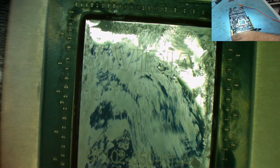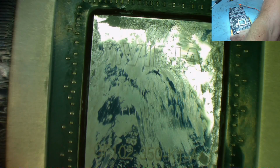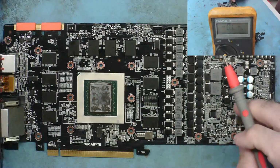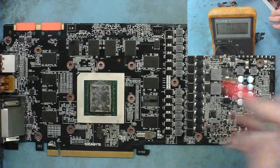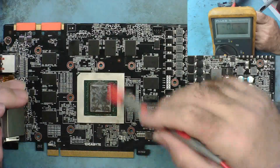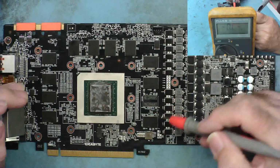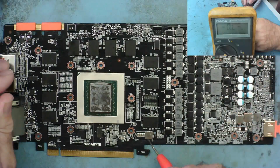Okay, let's zoom back out and let's go over to the overhead camera and let's take some resistance measurements. Okay, let's go through the motions then anyway. So I'm expecting, if this has got a short circuit GPU, that we're going to have a problem on the PEX rail being low resistance to start with. Well, let's see, I think that's the PEX, I don't know these cards.